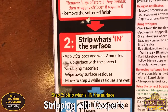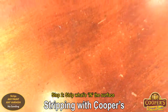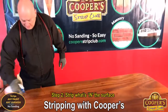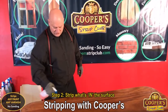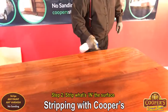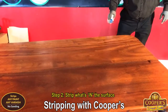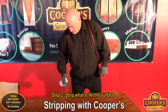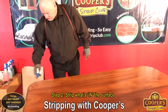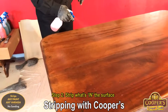Part two: strip what's in the surface. When this was made it was sanded, and the very first coat of lacquer that went on soaked into the wood. Then all the other layers of lacquer that went on after that laid on top. So when I was spatulaing, that removed all the stuff that's on the surface. Now I'm taking off what's in the wood. With a stripper that's highly acid or alkali, this is when the wood gets destroyed or bleached, and that usually results in many hours of sanding.